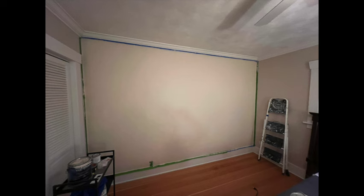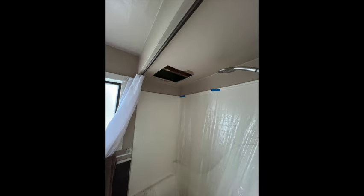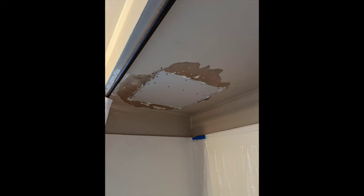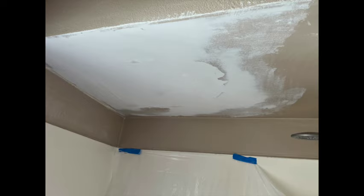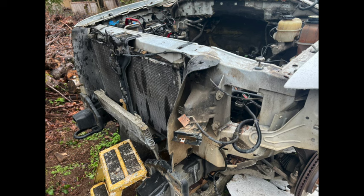I didn't do too much on the shower — I've been busy with client work. One client had a plaster wall all messed up so I patched some big chunks and cracks and it looks pretty good. Above their shower they had a leak, so I cut out a big rectangle, framed it in to put a big patch piece in there. All that torn paper I put some wood glue up there to make it not permeable anymore, then put some mud up there, sanded it down with a little orbital sander — super dusty — and painted it. They were happy.